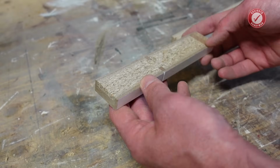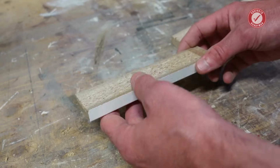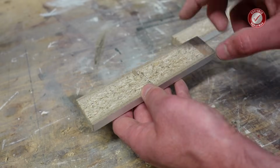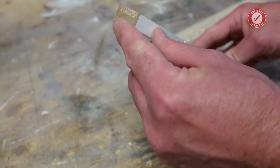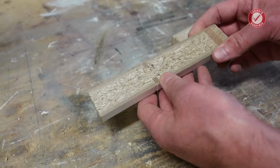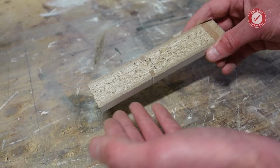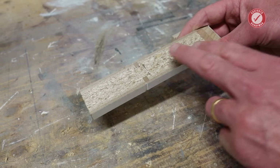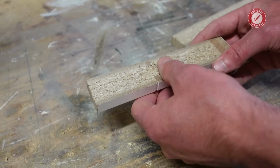On a door like this for a bathroom, it's not a fire door, it's not a particularly structurally critical door, and it's pretty sturdy anyway with it having a solid chipboard core to it. So I'm comfortable taking off more than just the lipping. I've probably invalidated the warranty, but I don't really care. But as long as the base of the door is nice and sanded and it's been primed so moisture can't get in, and there's nothing that's going to get caught on the carpet, then I don't personally view that as being a huge problem.